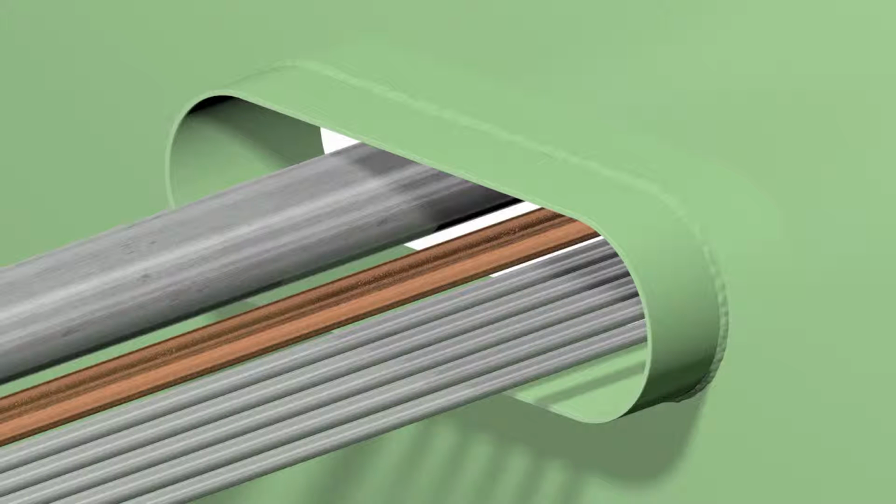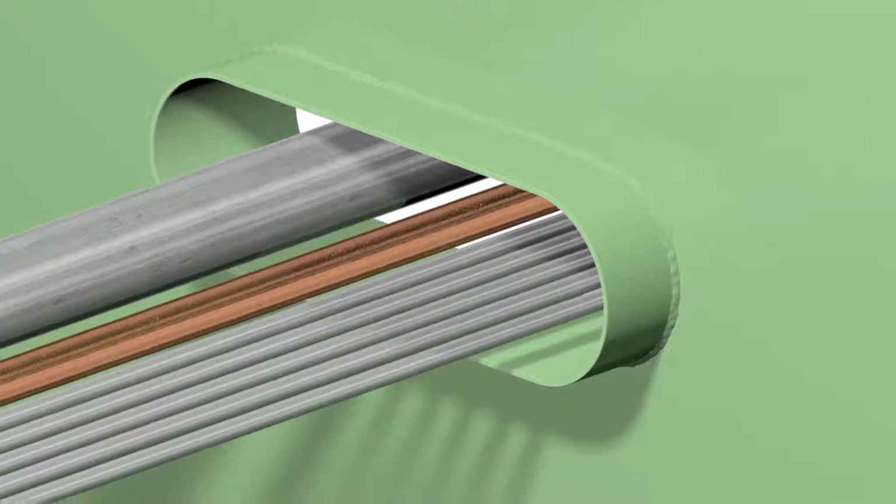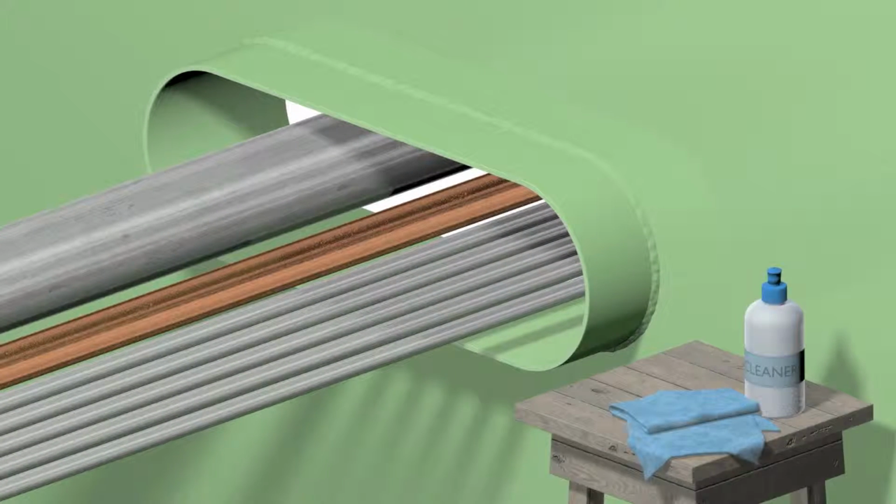The interspacing between the ducted pipes and the minimum distance to the wall of the conduit frame are also of utmost importance for enabling adequate cleaning, which is an important step in the installation. Final sealing of the pipe penetration may take place quite some time after ducting the pipes. In those cases, the status of the inside of the transit frames has to be checked again before starting the installation of the sealing system.